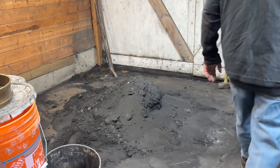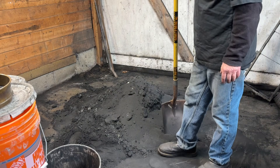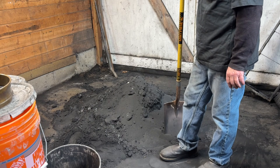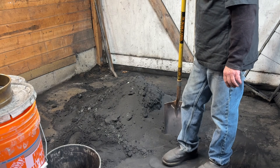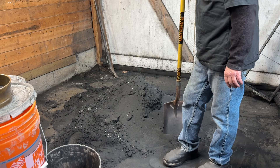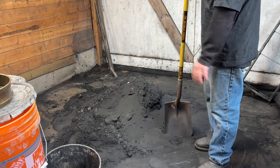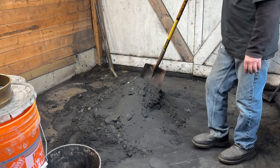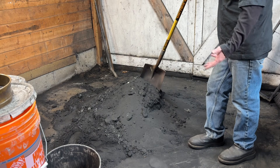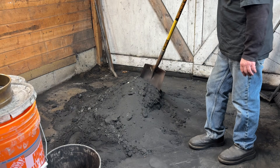I'm going to try to give folks a chance to see what it's like in the foundry when I mold sand. This is a pile of sand that I shook out of a couple of molds a few days ago when I cast a 36 camelback and then an 18 prism straightedge. What we're left with is a bunch of green sand that is kind of lumpy and has now dried some from when it came out of the molds. It was fairly moist then, but it sits here in the barn and dries out with time.